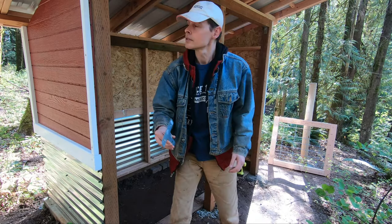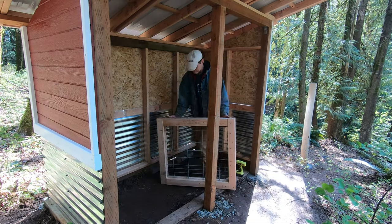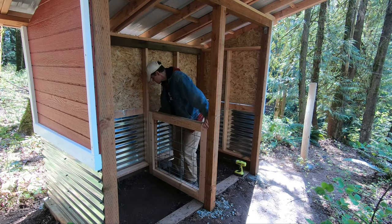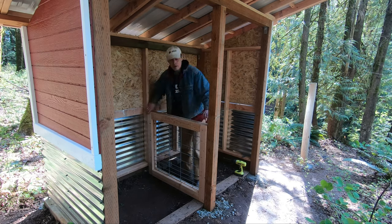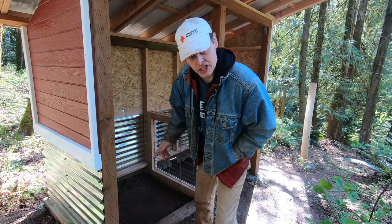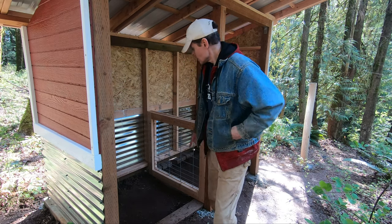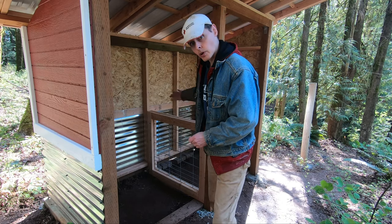Put this bracing plate on the back side where you won't be able to see what I'm doing. I used the Kreg Jig to do pocket holes before I put this 2x4 sandwich together. That way it's real easy to attach it into the wood supports.